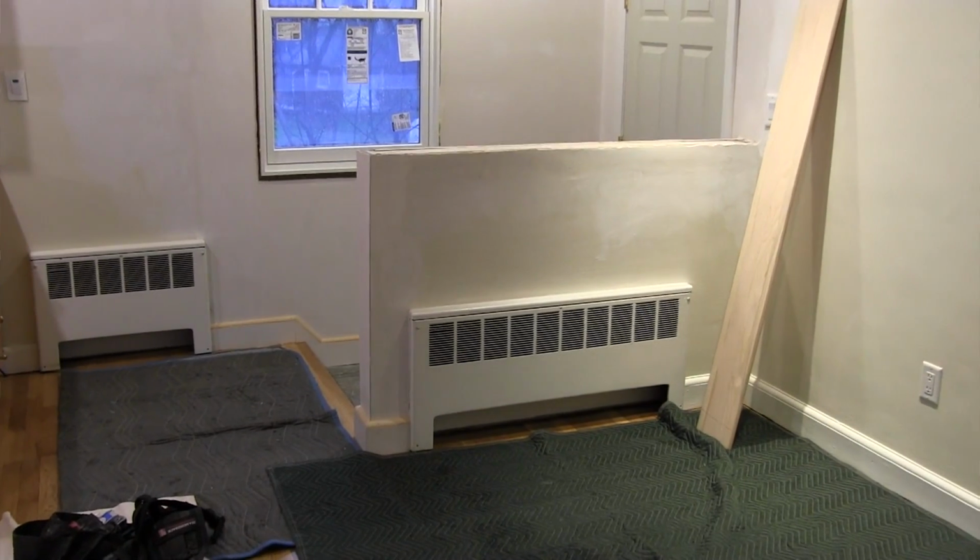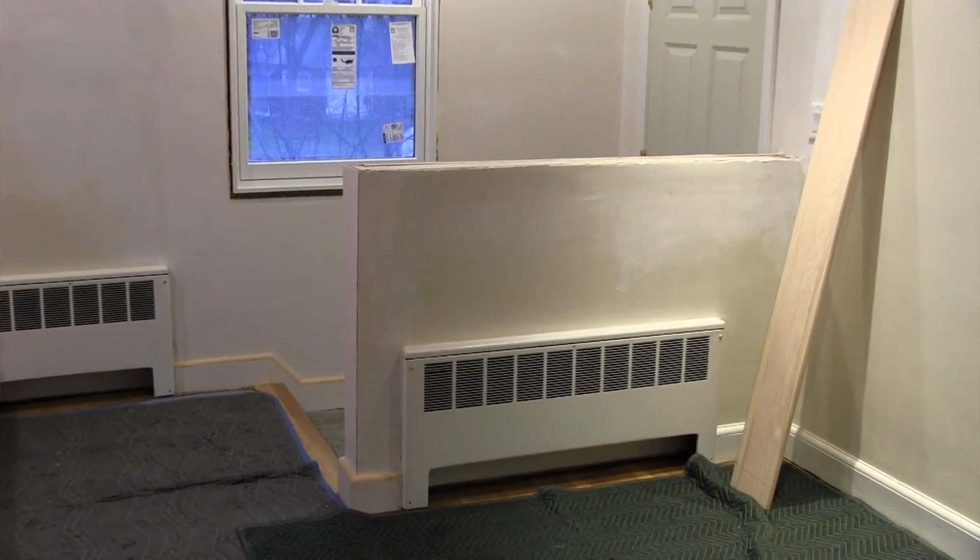One side had plaster on it, the other side had 3/4 sheathing. We left that 3/4 sheathing in place because it helps stiffen the wall. That was the old outside sheathing. Additionally, we added on the outside edge of that wall some 2x4s all the way down into the floor joist area, and we tied them in with structural screws and some wood blocking to stiffen that wall up, and it significantly helped. So we were able to take the flex out of the half wall.